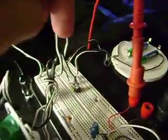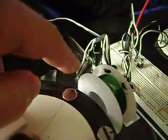This coil here is the older coil I was using — I'm just using that to drive the wheel. Just a little simple switch, the two batteries, and the reed switch here. I left it together in a reed relay because I'm going to use the coil as a sensor of some sort later on, or maybe to operate a transistor to drive this.